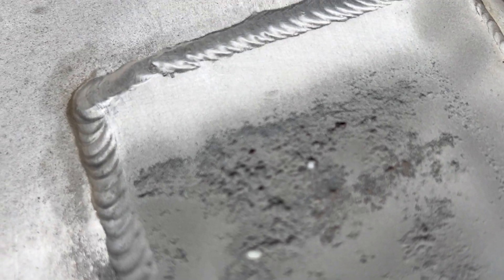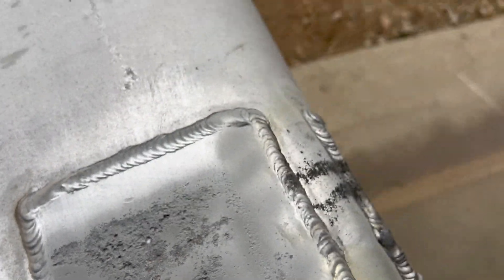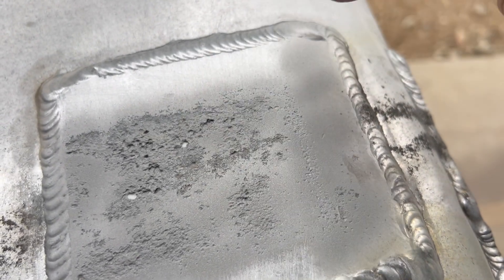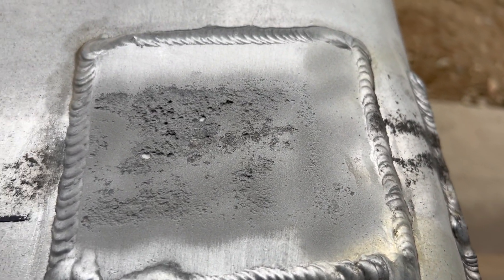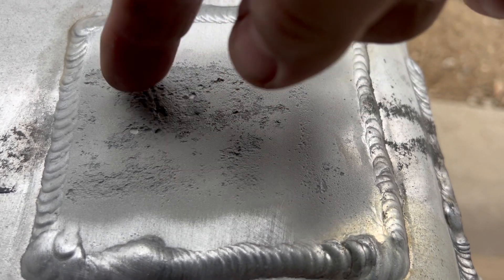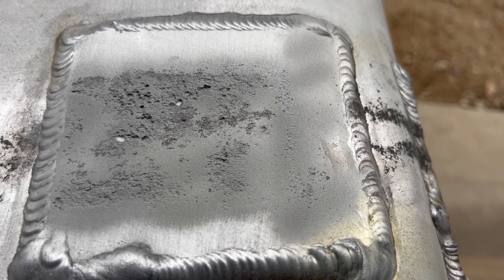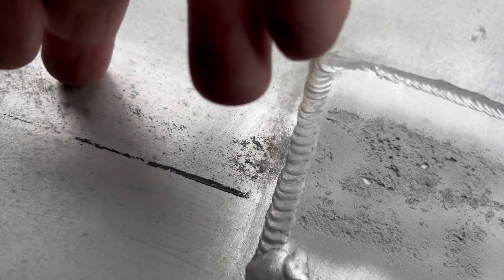After sandblasting, you can see that moon-crater effect going on here. If you have a hole, it shows as a wet ring around it from the diesel fuel. At this point there are no holes yet, but there are still two areas that need a bit more work to get the material out. I'm going to weld-fill these really deep craters to make sure there's enough meat there to hold it and not seep through. Normally I'd weld them up first and then put the patch over it.